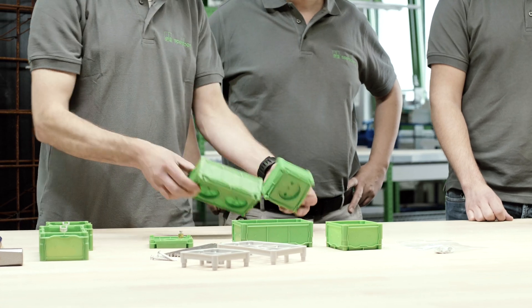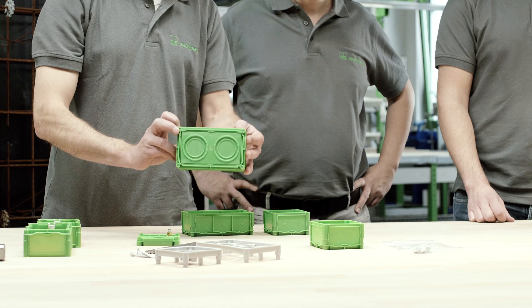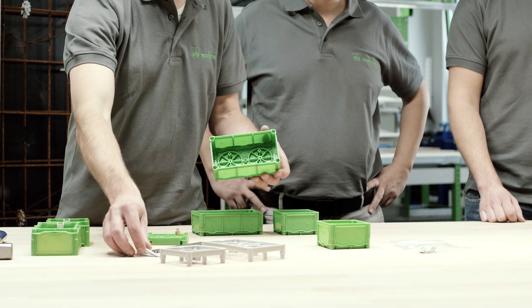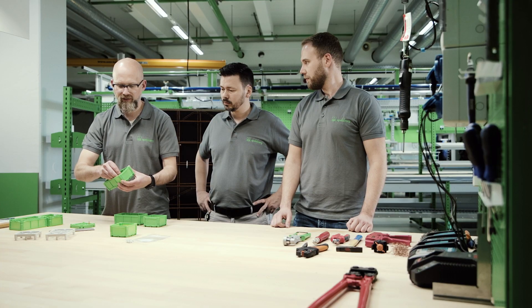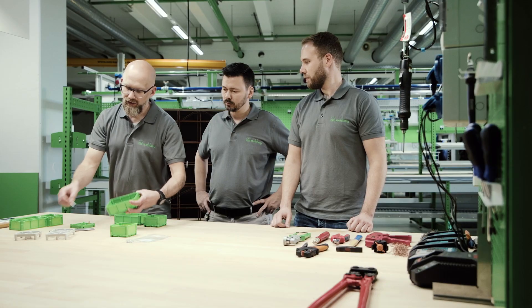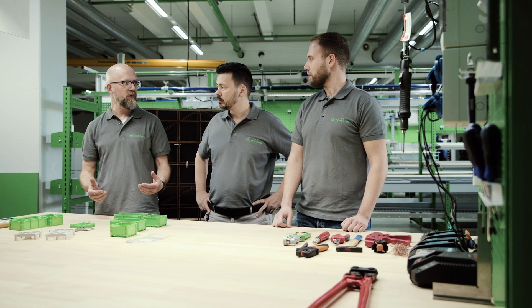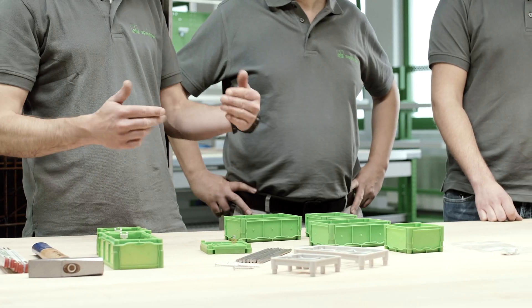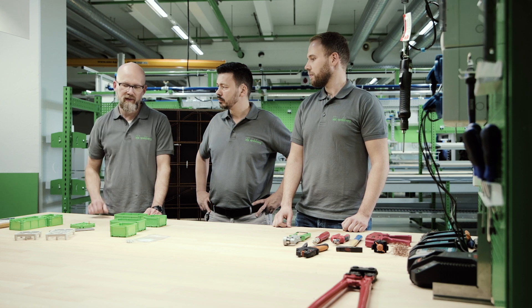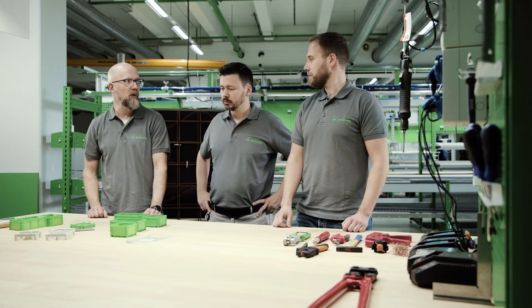That's right! We have the option of fastening the magnetic variant for round magnets and the adhesive version on the rear to the wooden cast, using the additional nails designed for this. Unlike with the U71, where we have a reinforcement box for the opposite formwork, in this case, we need to revert back to our proven support spar technology, which, of course, works as well.